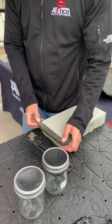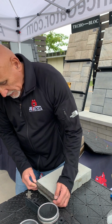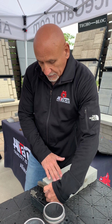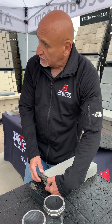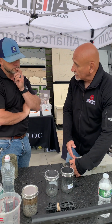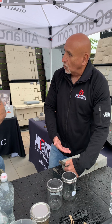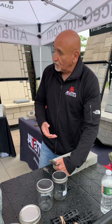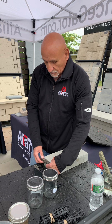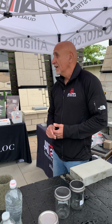So when I have it all swept in and compacted, and then I take a blower and set the sand height where I want it, and now I water it, imagine this is acting like a funnel with the paver on the other side. Now it's got a recess there, and it's funneling water into the product. If I had the dry sand up here, it's not going to accept water readily. If you think you're watering it adequately, it's not enough water. So there's a lot of reasons why we say what we say, and why it's right.